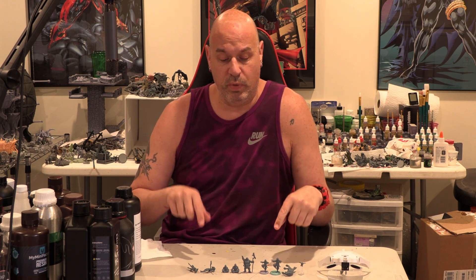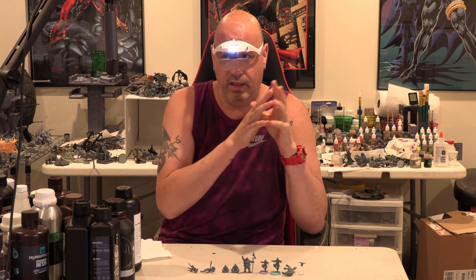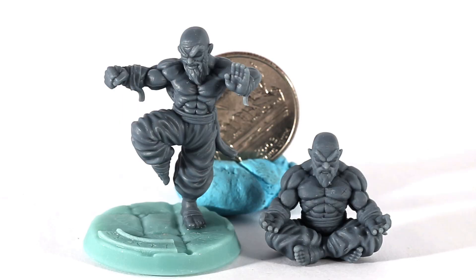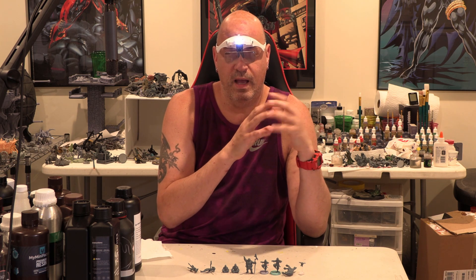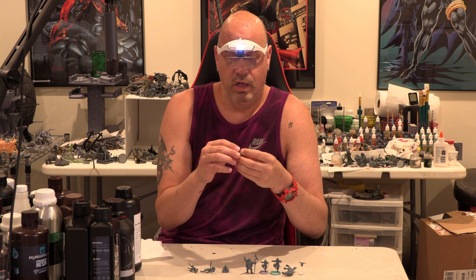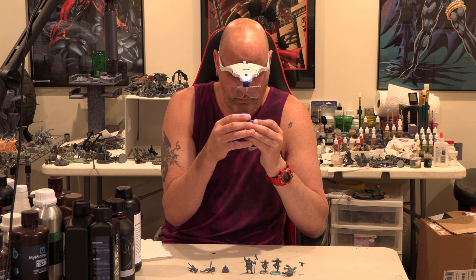I was actually surprised how well this printed. Let me put on my nerd glasses to look at these up close. With the increased resolution — the last DLP I reviewed was the original Anycubic DLP at about 72 to 75 micron resolution, and this one is about 52 microns — I could see lines and voxels clearly on the Anycubic at that resolution. The technology just wasn't up to snuff. But I said if it gets higher resolution it'll be good because DLP does print super accurately. Was this increase enough? The answer is a resounding yes. You and I looking at these photos cannot see lines anymore.